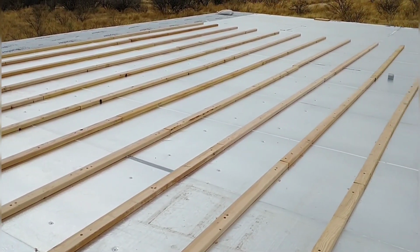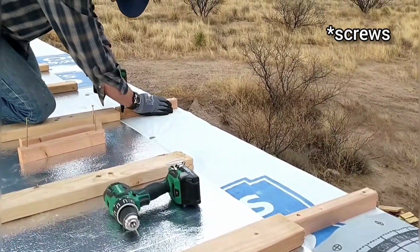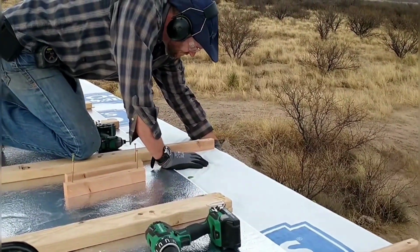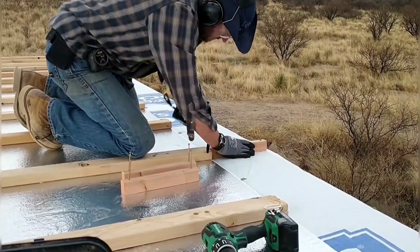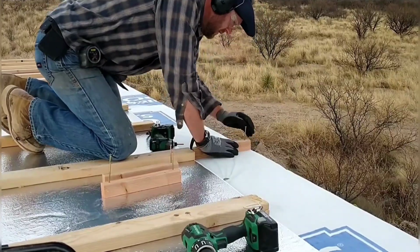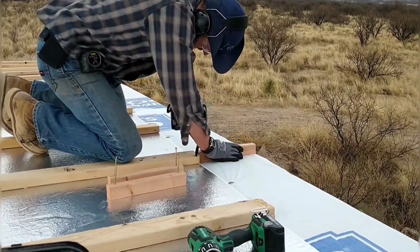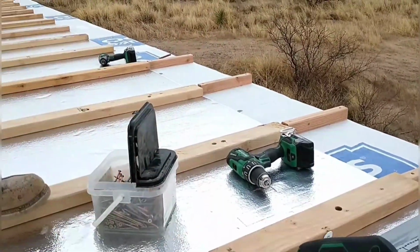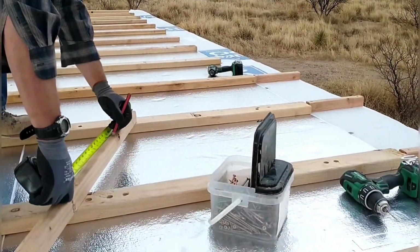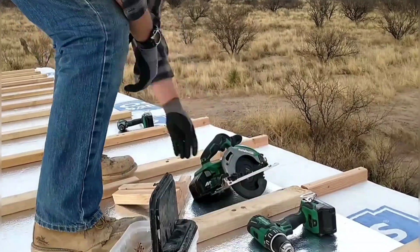Wherever the metal will be screwed into these strapping boards, I've screwed the strapping boards all the way through the roof to the purlins with those heavy-duty structural bolts. Those strapping boards only covered the foam in the middle of the roof, and I had to use a special height of board on all of the eaves. The reason is I wanted to get that elevation to match up perfectly, and unfortunately the height I needed for the eaves was 1¾ inches, which is 1/4 inch more than the 1½ inch board that's on top of the foam holding the foam down. So I had to rip some boards to 1¾ inches and then put in little pieces along the short side here. Along the other two sides of the house, I had to run strips of this the width of the house. By piecing in these shorter boards, I continue that strapping all the way to the edge of the house. That gives me a surface to screw into when I'm screwing the pro panel down all the way to the edge of the house.